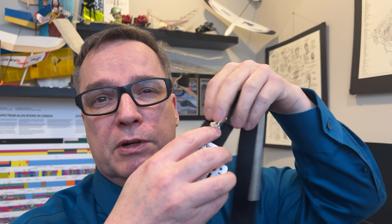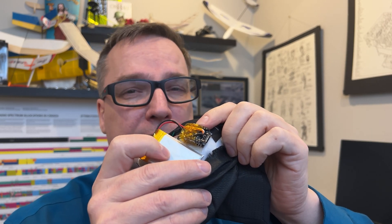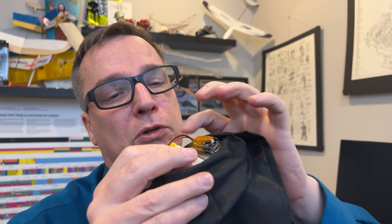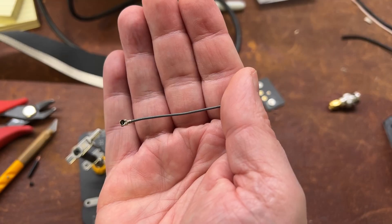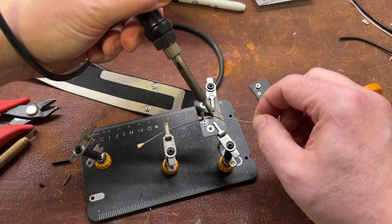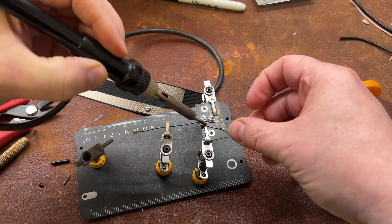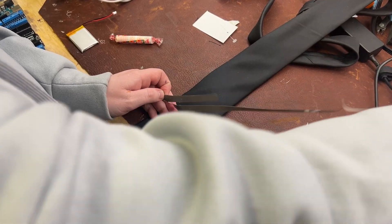For this to fit into the tie, we're going to need to get rid of a lot of the bulk. I don't want something like that dangling from my neck, and I don't want this entire piece either. If you look on the inside, the entire controller is that piece right there — super light. Got a battery, got the controller, comes up to the antenna which you see on the outside, and then the Bluetooth antenna is just there. I'm going to take the IPEX connector — the little tiny guy that hooks up to the coaxial cable onto the board — and solder it onto one of my blank circuit boards. We're going to add some hot glue for strain relief because these things are tiny and they're going to get yanked around. I'm lucky to have my assistant Autumn around to help me build some of these things.